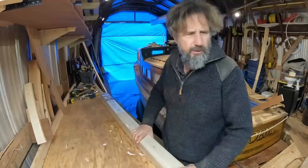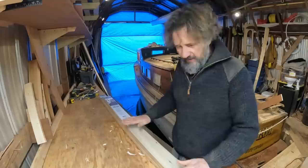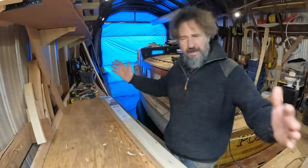Good morning, it's time to get that ceiling V-joint in against where the bed is going to go, and I have splurged on the somewhat more expensive and quite hard to find cedar in this material, which is a thin 5/16 tongue and groove V-joint. The cedar is much better quality because it's going to be right up against the bed and always visible. I wanted to use some better stuff. So let's get this stuff cut to length. It's very simple. It's all exactly the same length going right in behind the bed and get it tacked on.